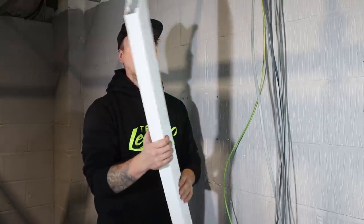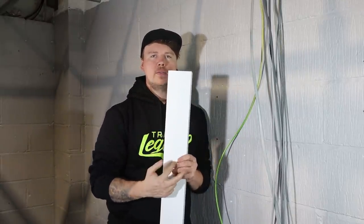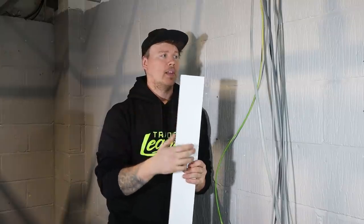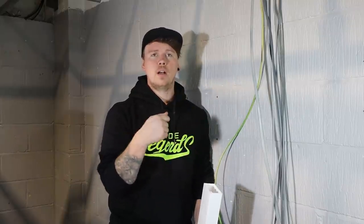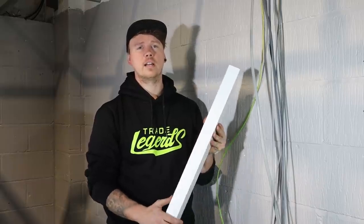So this is the process we sort of go through. First of all, trunking - we want to measure it out. We're going to get this drilled out the back, because we're going to want to do quite a few fixings in the back, and that's going to allow us to fit the D-clips too. So we'll mark that out, get that level on the wall, and we'll use our Marksman as we spray it onto the wall to give us a nice chalk line. Making sure everything's level - that's a key thing. Make sure we've got a nice separation between the clips at the correct distance per regulations.